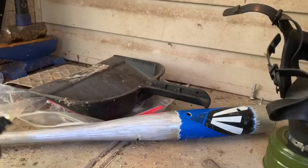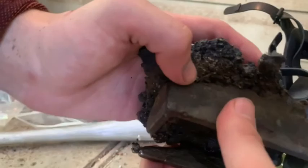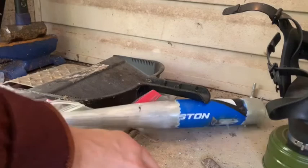Excuse my horribly messy workstation, but this is what we got. Fairly good for the first time ever trying to cast iron. And the issue was I did not have enough iron, and then the slag fell in, which is why you can't see the letters too well, because when the slag fell in, it completely deformed the top layer of the sand.